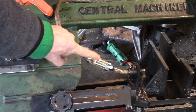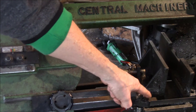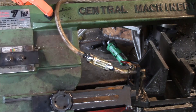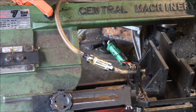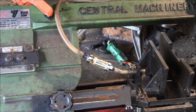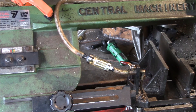The nice thing about having the clear filter is it helps diagnose two problems. If you turn the saw on and see coolant coming out on the blade, everything's good. However, if you don't see coolant on the blade, look at the filter — if it's filled with coolant but nothing is coming out, the filter is clogged. The second problem is running out of coolant in the tank: when the level gets low enough, the impeller starts generating foam and bubbles, and you'll see that foam show up here — that's your cue to add another gallon of coolant to the tank.